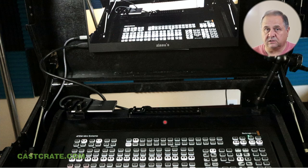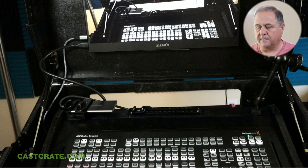That eliminates the need to add pass-through ports on the back. That's the most expensive part of building a case — adding pass-through ports. An average HDMI panel mount pass-through port is anywhere from $8 to $25 each. So if you have an ATEM and you want eight camera inputs, two HDMI outputs, two USB-C outputs, a power output, and an Ethernet connection, just your back panel can cost you some money. We've come up with a couple of ways to do it, and it's upgradable because we've taken the panel, made it a cutout, and added a boiler plate over it. You'll be able to upgrade to a different style case pretty cheaply.